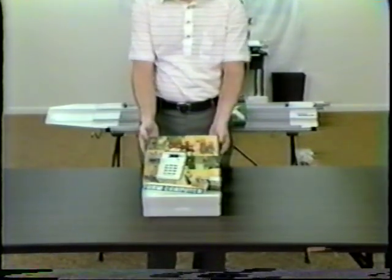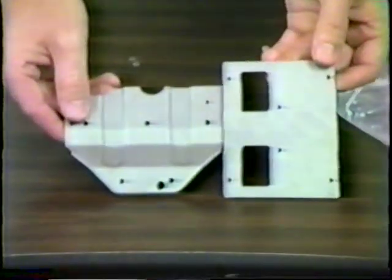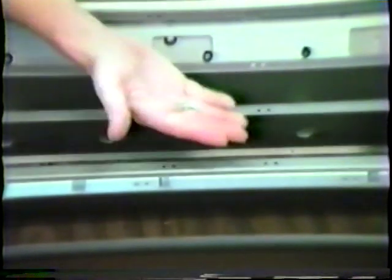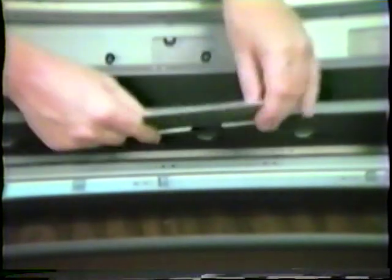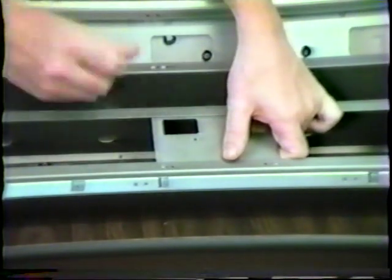This is the assembly of the form computer. We want to attach this stiffening plate and this connecting plate to the back bed of the machine. We will be using these 4 large silver screws. Put the stiffening plate on the inside of the frame. Notice that the holes face inwards.